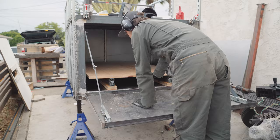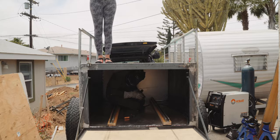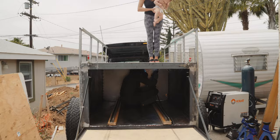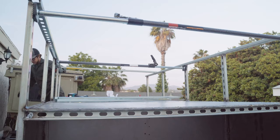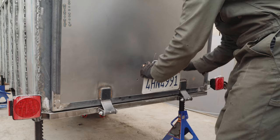The roof sheet was a perfect fit and didn't need any trimming before welding it down — again, lots and lots of small welds to prevent warping. When you need it, don't be afraid to ask for help to stand on some metal to ensure proper tolerance before welding. I may or may not have burned my beloved shoe in the process. The vertical rack supports warped in the heat of welding, so I picked up a couple of spreaders from Harbor Freight to fix the width of the rack before bolting down the cross bars.